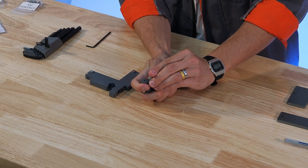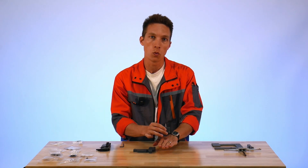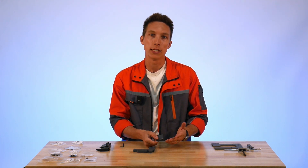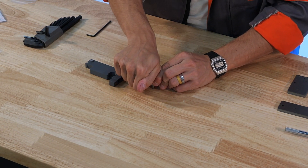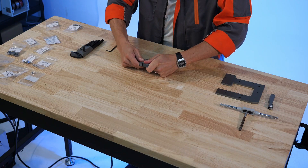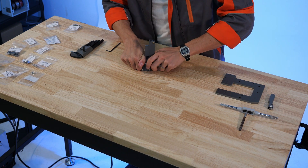The reason this part is supposed to be a tight fit is because it prevents X, Y translation of the wire in relation to the tool itself. If we can prevent that sort of translation, we'll have a more accurate cut during our EDM process. Don't be afraid to press the part against a stable surface — this is meant to be a pretty tight fit, so press until the part is bottomed out and both parts are more or less flush.